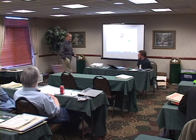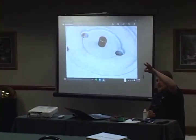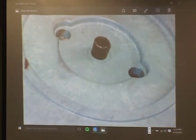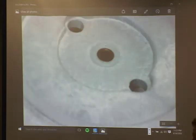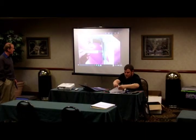Oh, incidentally, if you're going to do the height adjustment, there's a long, thin hex wrench that goes down through the middle. That one, the 8-inch one. About 3 inches lower, it'll find a contact point. Okay, this one. And that's the alignment for this when you glue this back: it's exactly flat with the plate, flush at the back. There's no adjustment measurement to be made. Cool.